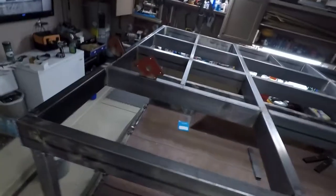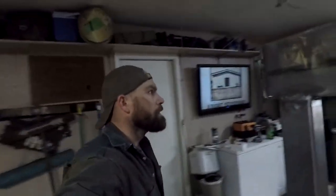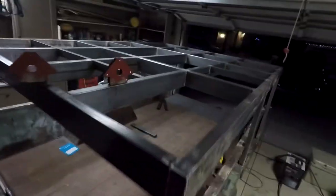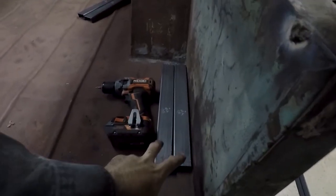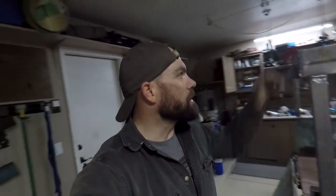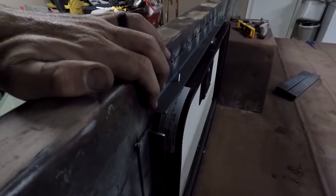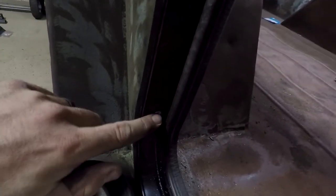I'm done for the day. What we have done is frame out as far as I can the top deck piece. You can see we are missing a section here — there are actually two pieces that go there. It's on the back right corner and front left corner. We're going to have some swivel chairs up there for hunting, and we don't have the axle piece that's going to support those yet, so I can't frame them out. We are as far as we can be. What we also did today is the door for the battery bank — it's installed. We have put some angle iron back here to get the screws installed for it, just some self-tapping screws.